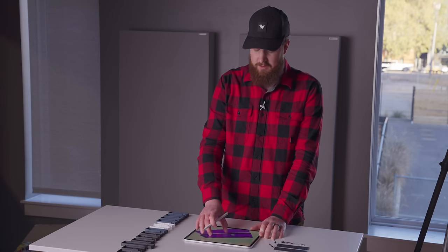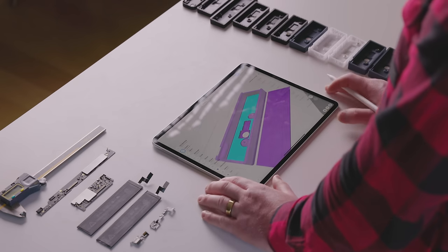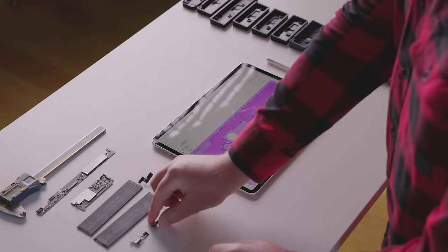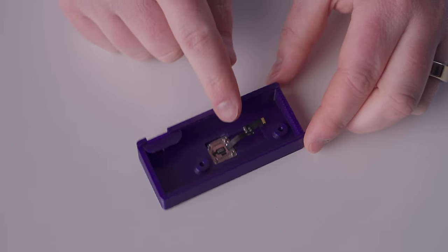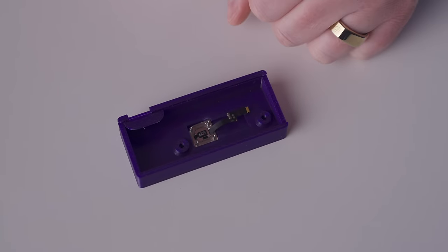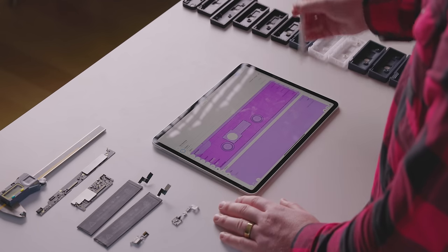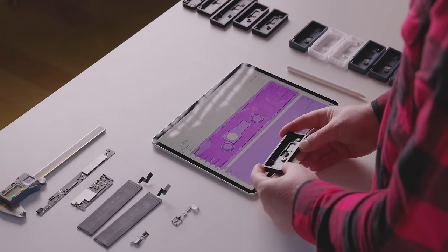And with a lot of trial and error and a lot of chamfering and filleting and adding and subtracting, I got this part. And I want to show this to you because it's pretty simple. So I've got my 3D fingerprint sensor that goes right here. As you can see, there is a cable that extends out. And so I wanted to create a little cavity inside my part so that it wasn't getting smashed by the board above it. Then we have these two little plateaus. This is where the board sits upon.